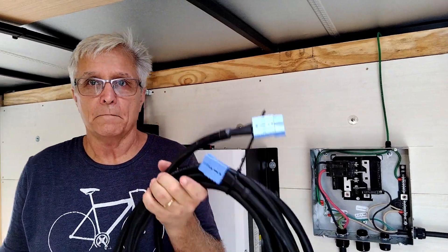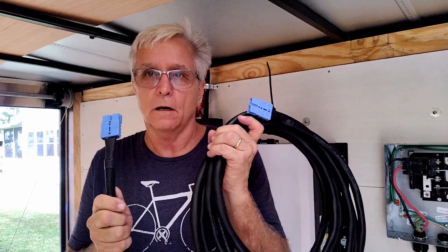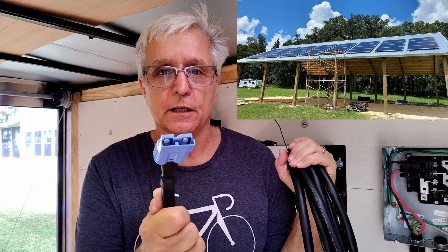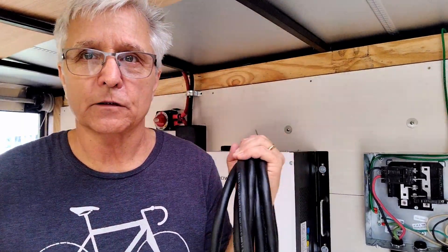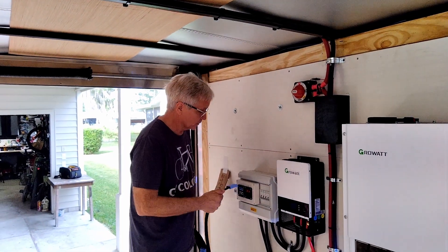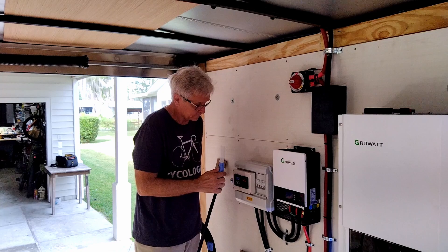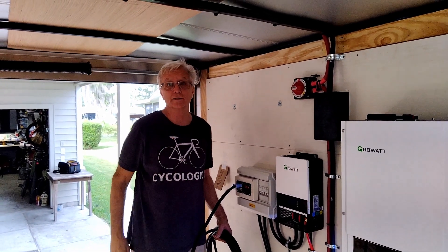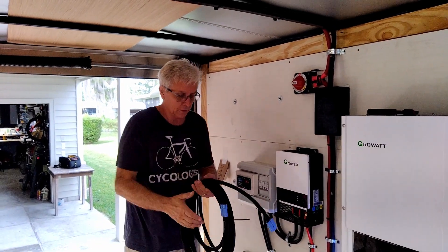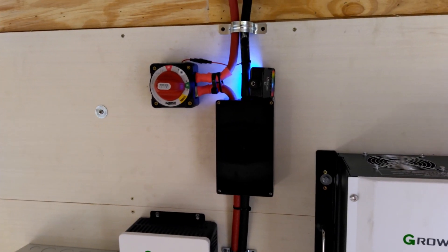I made up four of these — they're 8 AWG wire, for the solar panel connections from the pole barn. These are Anderson connectors, color-coded and key-locked so that only each array can go into only its matching color. You plug half of them in on the outside on the power pole, and the other side comes in and plugs in right here — just like that, makes a really nice lock. Probably going to put a little piece of strapping here to keep that tight. These are 25-foot cables, so they've got plenty of reach, and I've got four of those made up.